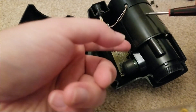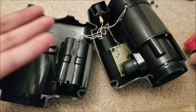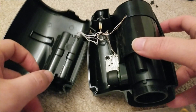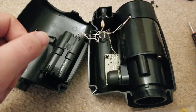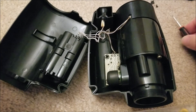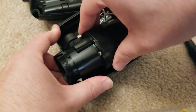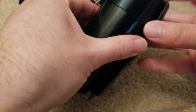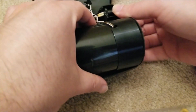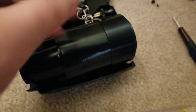The tube runs at three volts externally from the user's perspective. A lot of these tubes run on relatively low voltages like 1.5 to 3 volts, but there's actually a step-up converter inside — because this is a vacuum tube it requires a couple thousand volts to operate properly. We are going to carefully wiggle this out — it should pop free because we removed the screws on the front. There are also some retaining shims in there as well.